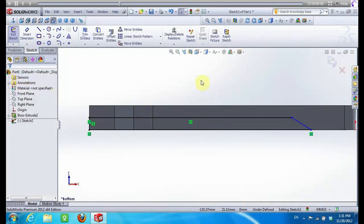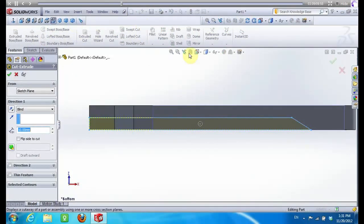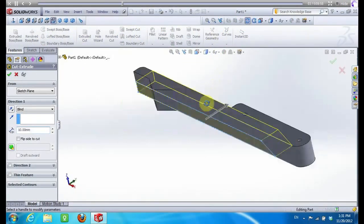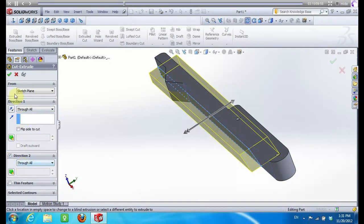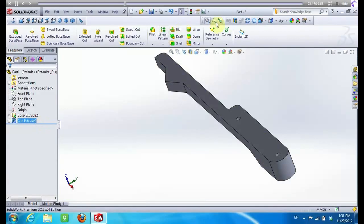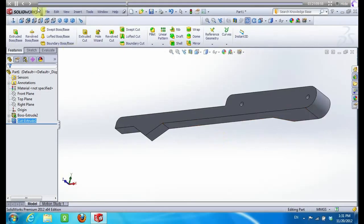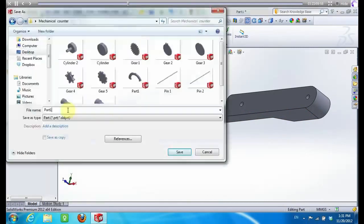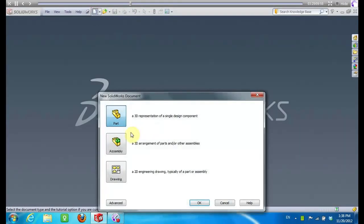Go to feature, extrude cut, select through all and direction 2, press OK. Save this part as part 2. Now exit from this part. Go to new part,